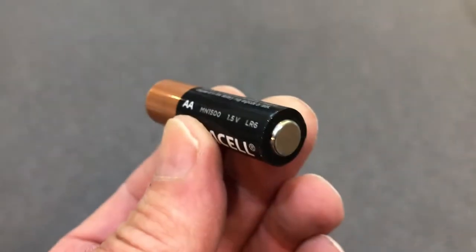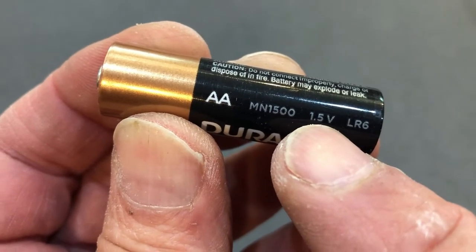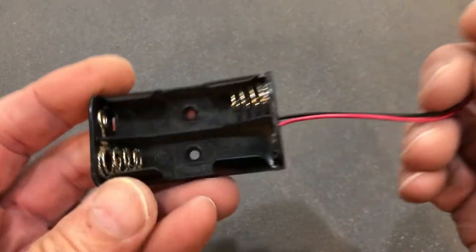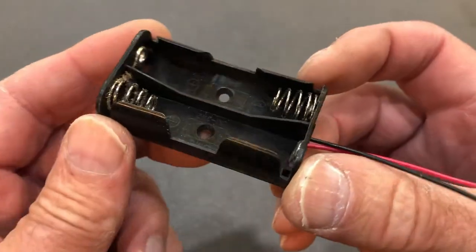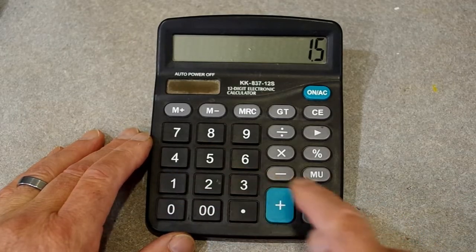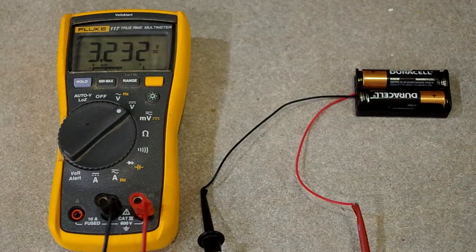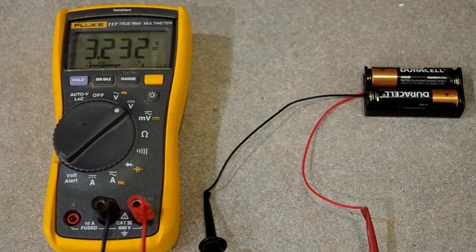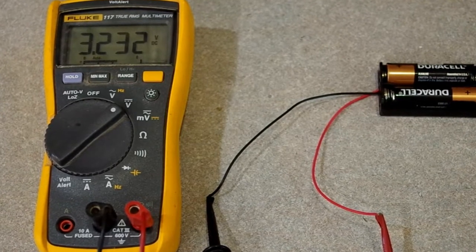This AA battery is rated at 1.5 volts. When it's brand new the voltage will be a tiny bit higher, 1.6 volts. This is a three volt battery holder that connects two AA batteries end-to-end. Each battery is one and a half volts, connect two end-to-end or in series in the battery holder, you just add one and a half plus one and a half, and behold, three volts on my digital voltmeter — actually 3.2 volts because the batteries are brand new and are actually 1.6 volts each. You don't have to have a voltmeter to hook up LEDs, but I highly recommend getting one. Any cheap model will do.